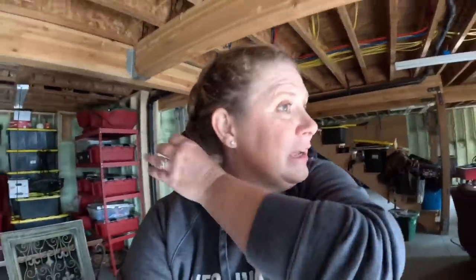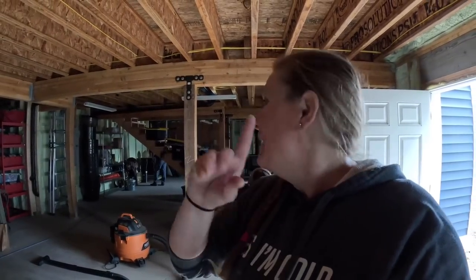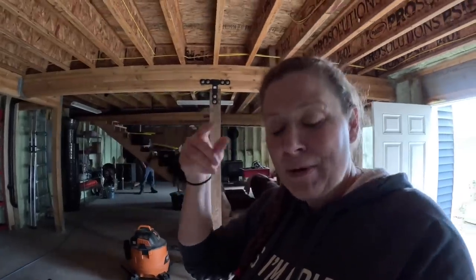Aaron is about to turn off all the power, so it's a little dark down here in the basement. Even though I've moved everything and there's nothing else on the breaker, it has several outlets. The freeze dryer is causing it to trip when I'm running it. Aaron went and bought the supplies — he's putting a larger breaker in and a dedicated line that is just one breaker and one power line for the freeze dryer alone. It depends on what I'm freeze drying: if it's taking a lot for the freeze dryer, it's tripping the breaker. If it's something light and easy, no problem — it just freezes and runs through the cycle without an issue. But when it's working harder, it is causing it to trip the breaker.